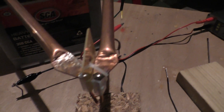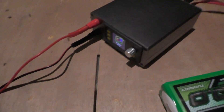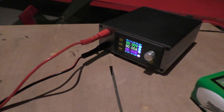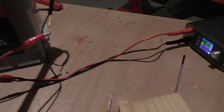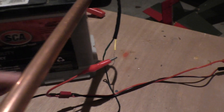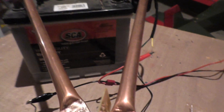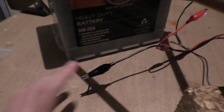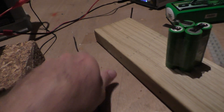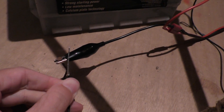It just doesn't work. So to get around that, what I've been doing is using this separate power supply, which is also current limited, which is kind of handy. I put that on - I think it's on 11 volts or something - and the positive of that is going to this terminal. Now previously that positive was going directly to the positive terminal on the battery, and that's how the guy had it in the video. I'm sure if you had a car battery that wasn't so completely useless as this one you could do it that way. Over here I have the negative terminal of that, and for my switch I just have a bare piece of wire, and I tap that onto here and you can hear the solenoid clicking closed.